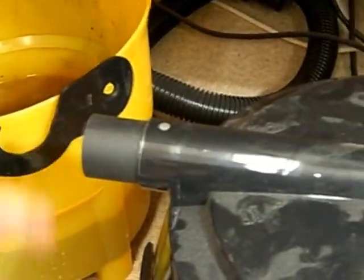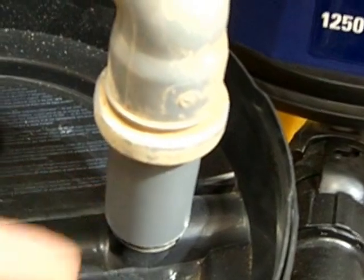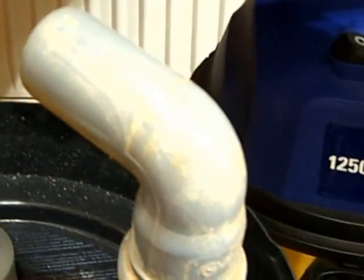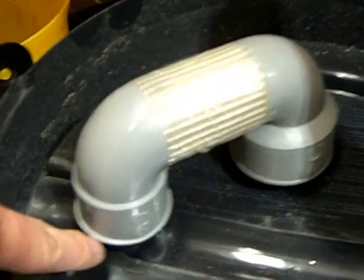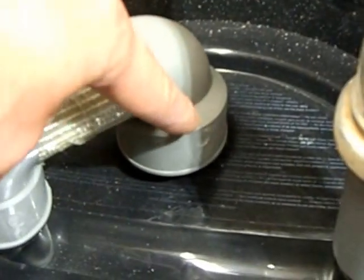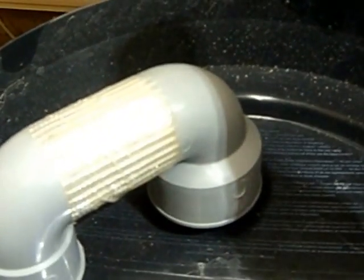The main thing is the lid. This has an inlet here and an outlet on the other side — they are not connected, as you can see with the seam here, no connection in the middle. On one side you have a 40 millimeter pipe, a normal drainage pipe like you find in your hardware store, and a 40 millimeter right angle piece. Here is the outlet, near the top so it doesn't catch any dust. I have a small 20-degree piece and one with a funnel shape so that the suction and aerodynamic flow is better inside. There's a little rubber seal inside, and the dust makes a centrifugal motion — the particles get pushed to the outside, fall through these holes, and stay at the bottom.